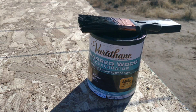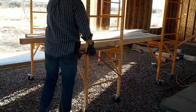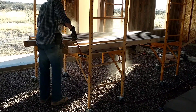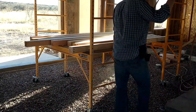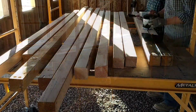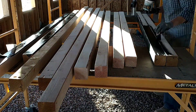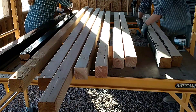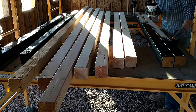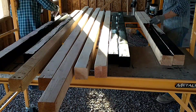It comes in two colors. One is the charred wood look, which is the black, and the other is a gray. The gray stuff is a clear liquid chemical that you put on, and it gets the wood to a nice gray — which is about all you can get from a natural darkening of wood. If you want to go darker, they have to add some kind of dye. This version has the chemical that reacts with the tannins, getting it naturally as dark as possible, and then there is a little bit of dye to get it completely black. I really like this product and it gets that really nice black look without open flame and ash.